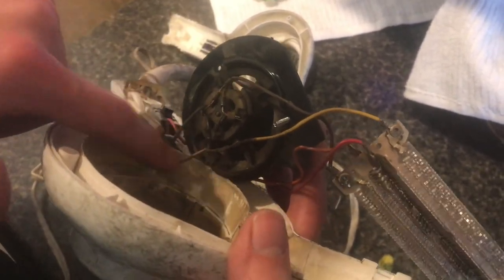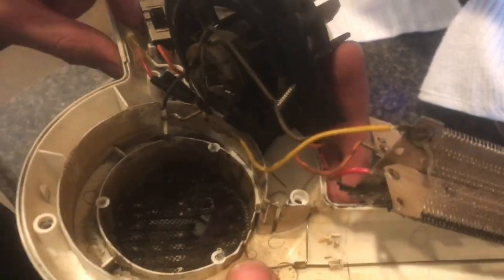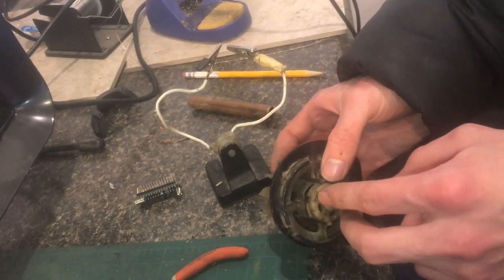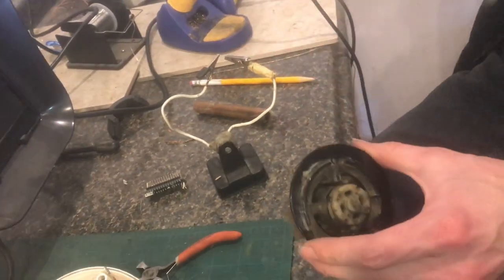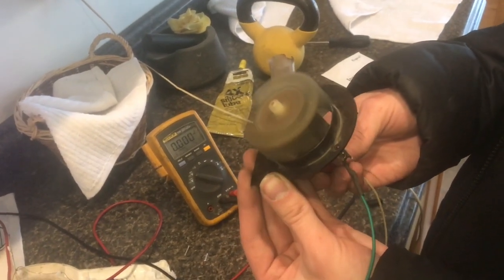You can see one wire — this white one — traces back to the switch. I'll hook it up to my 12-volt power supply and see which way makes the motor spin, and then I'll mark with a sharpie which side is positive and negative. This is a counterclockwise spin.